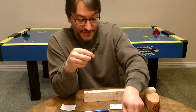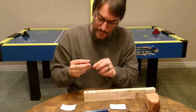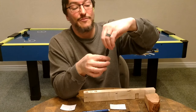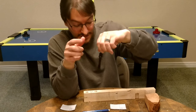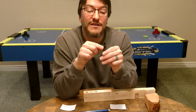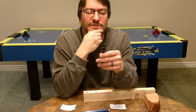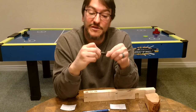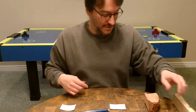I've got two stems so I can mess one up. My plan is to clamp the stem in the drill press chuck and spin it, then lightly apply sandpaper to the edge to make it round. I'll get my digital calipers out, measure exactly the size of the hole, and sand it down to just the right size. Then I'll sand off any teeth marks from the chuck — which I have to sand anyway to make it fit in the hole.